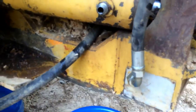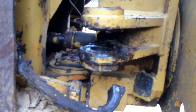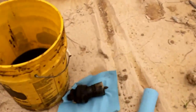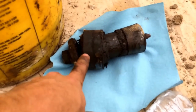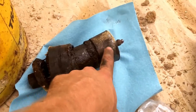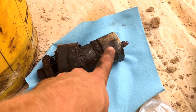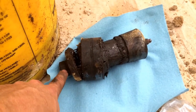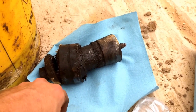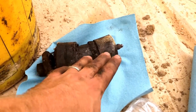Got the first bolt out — super easy. Here's the pin and the bushing. It's just got this retainer bolt that goes in the bottom. This pin is tapered, so you drop it in from the top and hammer it in as needed. When you put this retainer pin and bolt in the bottom it kind of sucks it all together tight and squeezes the pin down into that eyelet. That way the bushing is still loose to pivot, but the pin is stationary.